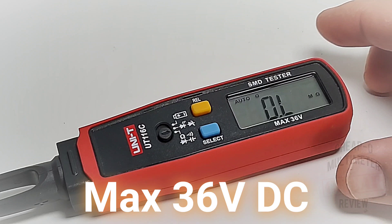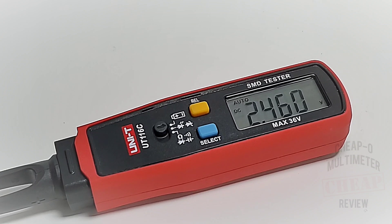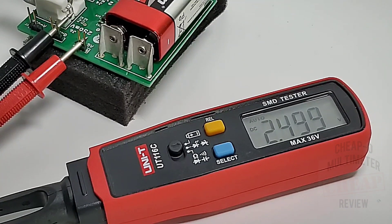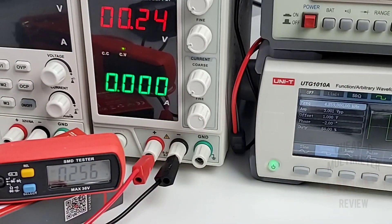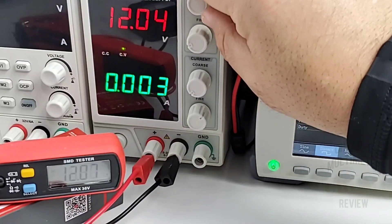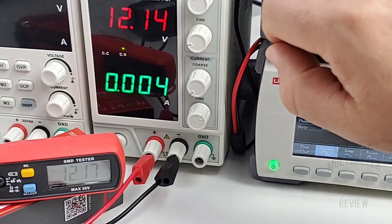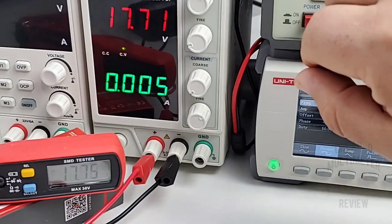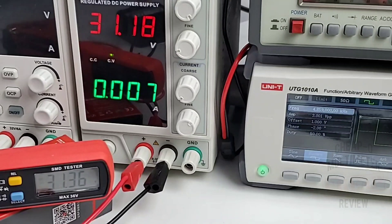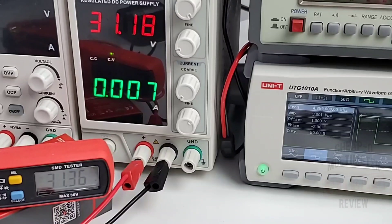Getting things started testing-wise by putting it into voltage mode, switching that selector over to battery. Remember: maximum 36 volts — don't exceed that. We should be seeing 2.50 volts — awfully close, 2.499, definitely in spec. Sitting around 240 millivolts, coming up as 256 on the 116. Let's take it up: 7.96 volts showing up as 7.98, pretty close. 12.14 volts coming up as 12.17. 17.71 showing 17.71 — beauty. Maxing it out: 31.18 volts reading 31.36. Not bad at all for a little SMD tester — remember, don't go over 36 volts.